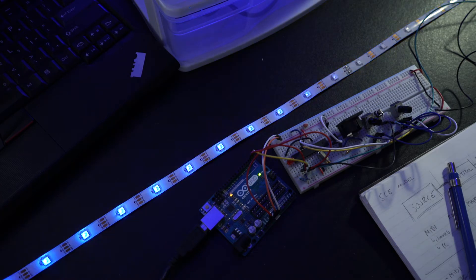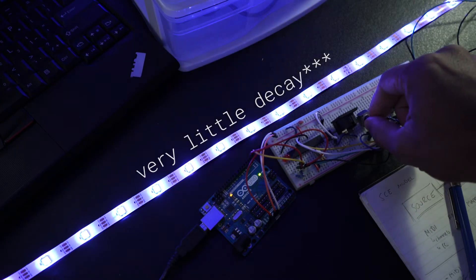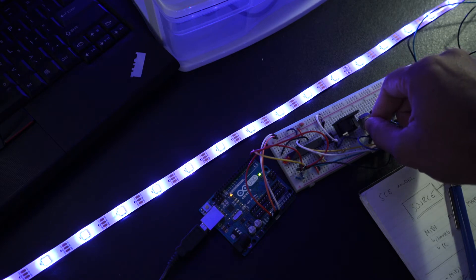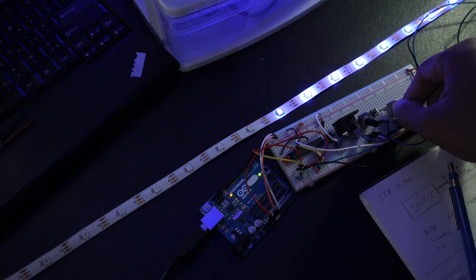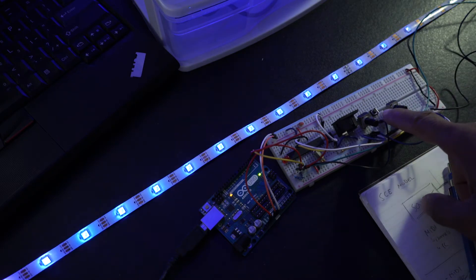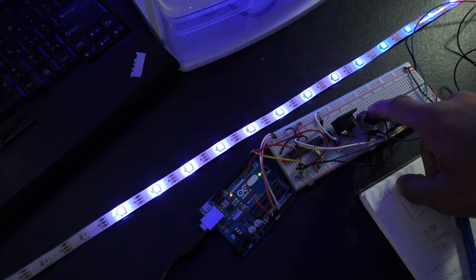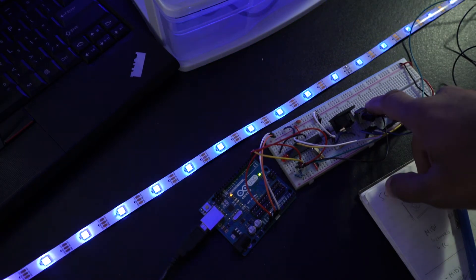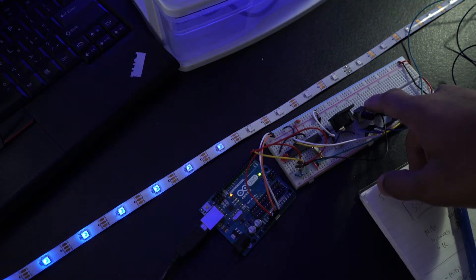I have this pattern going across and it's controlled by two knobs. One knob controls the delay or decay — from very little decay, to a lot of decay, to the point where it's always on. The other knob controls the speed, from super fast to very slow. I also installed a button that acts as a trigger, which displays a layer of three red LEDs on top of the purple pattern. However, when the purple pattern comes across the red, it wipes it out completely — that's something to figure out.